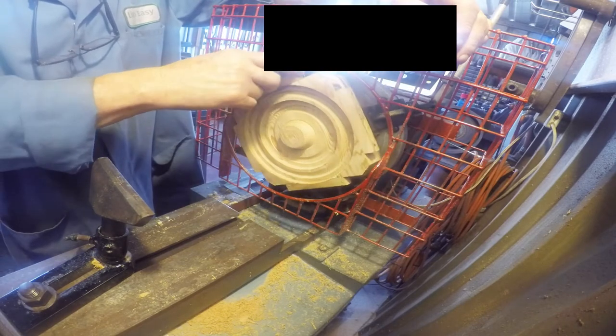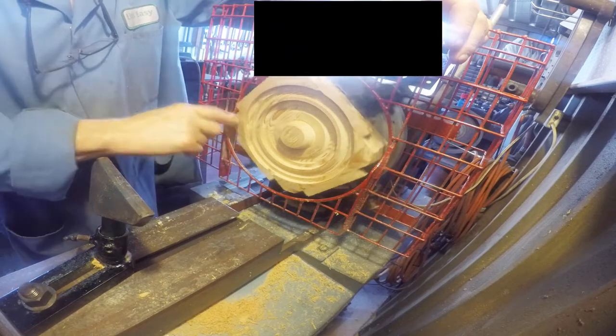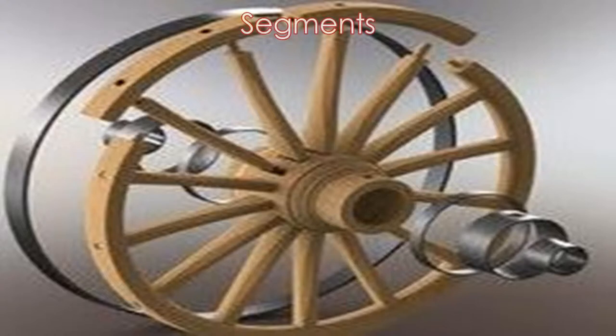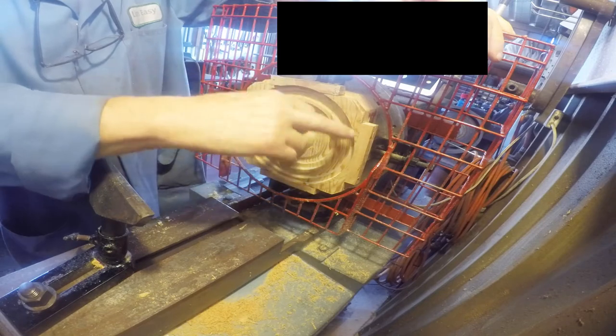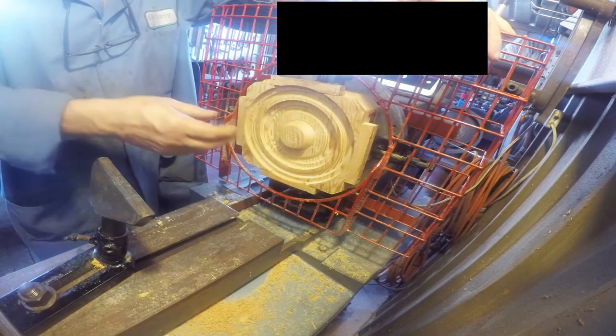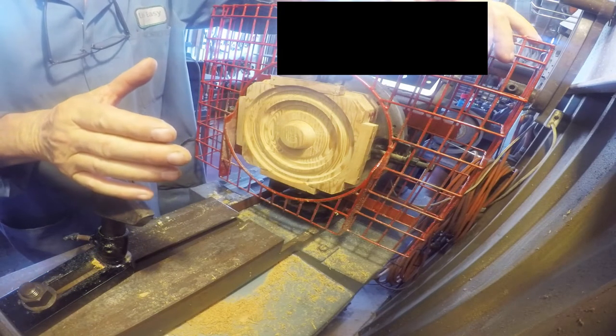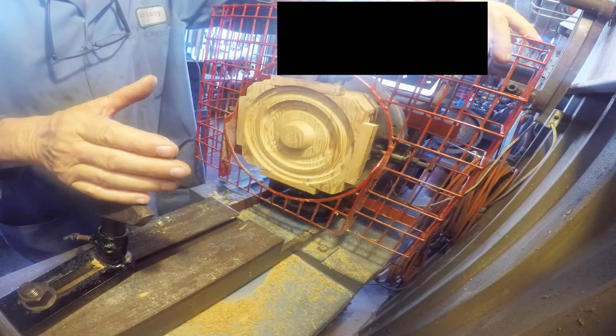The first large jig that I've ever had to make, and I'm sure these coaches' wheels are going to be spot on. I would like to do segmented tyres — where you have your main hub, put all your spokes into it as you see on wagons, then knock on the segmented sections on the tyres, probably in about ten pieces — that way you can get it to really look nice. But we're going to do it the long way and glue those wheels, which is going to take a lot of skill, and I'm looking forward to the challenge.